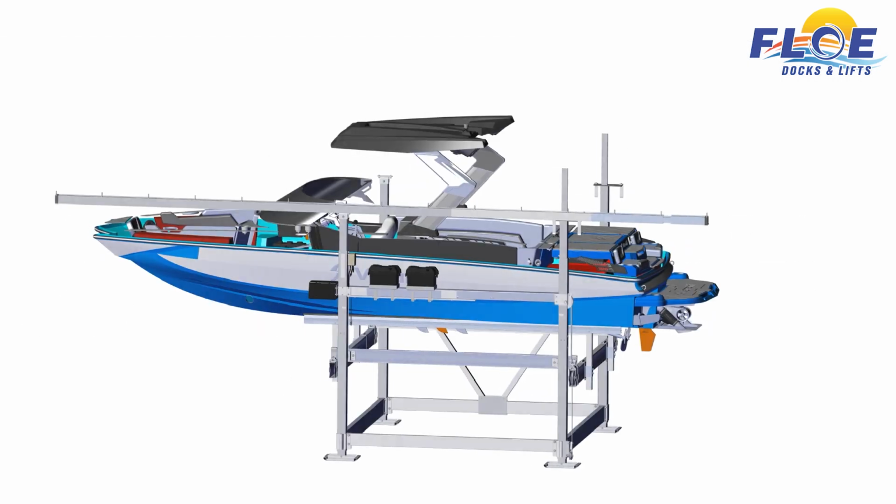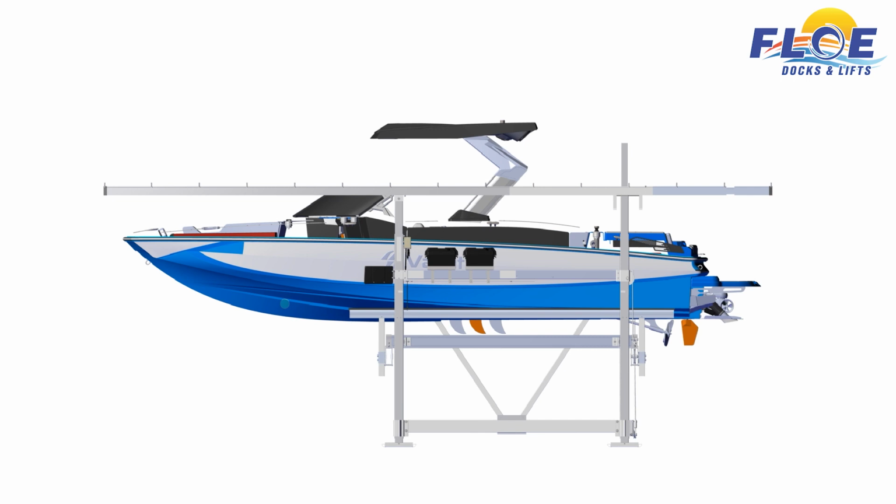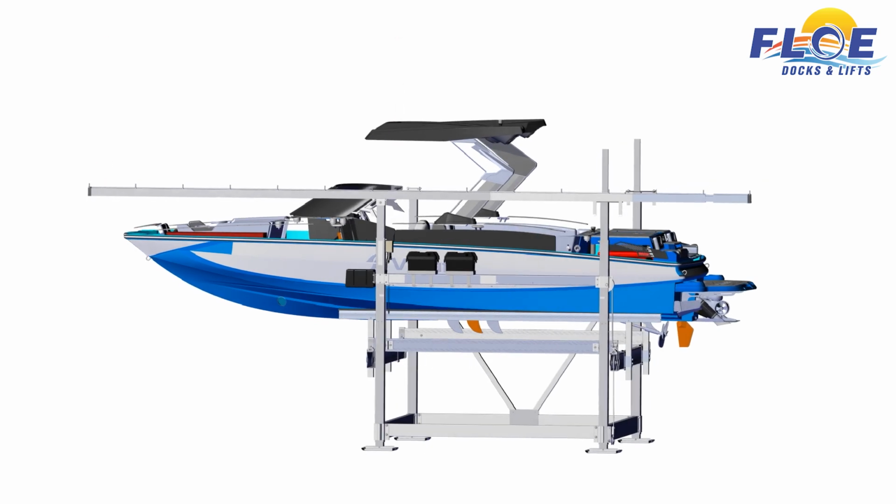Align the canopy rail to your desired overhang. The arrangement and overhang of the canopy will depend on the position, type, and size of the watercraft. First, ensure your boat's center of gravity is centered on the lift. Then, as a general rule of thumb, align the canopy rail to be centered with your boat when your desired placement is achieved. Take a measurement from the corner post to the end of the canopy rail and repeat the process on the other canopy rail.